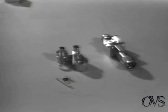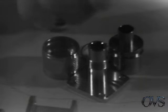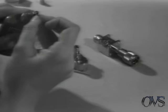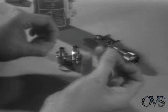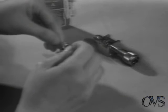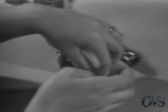In our first step of constructing the 1106B we're going to put together the male end connector. The first part we'll pick up is our male pin. Then we'll take our bead insulator and insert the male pin in the center hole. Then we'll apply a small amount of Loctite to the male pin threads, being careful not to get any excess. Then we'll insert it into the center conductor connector into the threaded end and tighten very snugly. Then that part is completed.